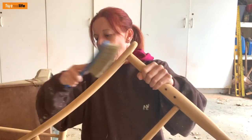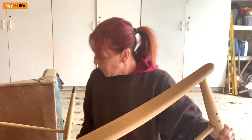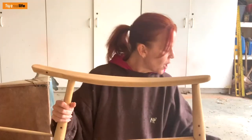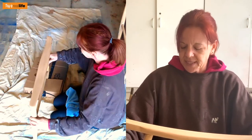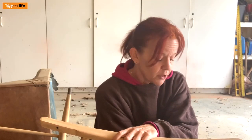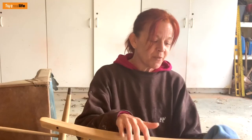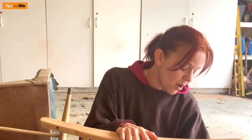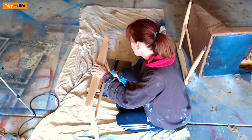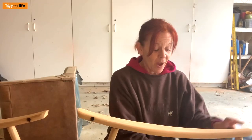Once it's good and secure, I'll wipe everything down with a microfiber towel and a little brush to remove sanding dust, then we can paint. I put together a box to hold the chair so I can paint it and let it dry without having to hold it. When painting furniture the correct way, you do light coats and lightly sand in between each coat. It's tedious but with furniture it does make a difference.